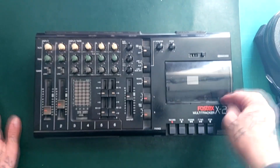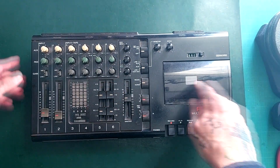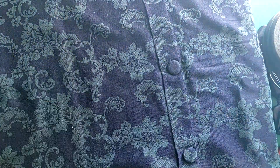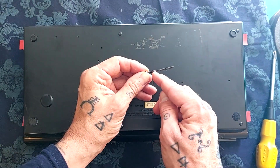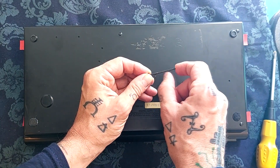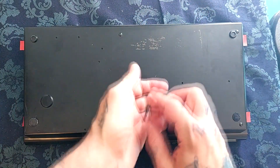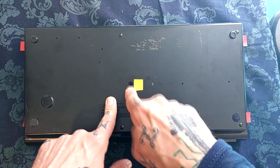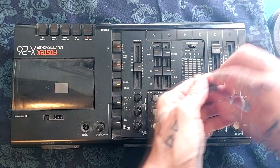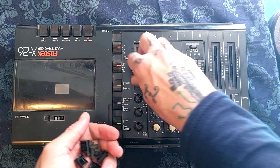Okay, so it looks complete - I can't see any missing knobs or anything like that. Next thing to do is figure out where the screws are on the back and put down a cushion so I don't damage anything on the front. Often from experience it is a longer one in the middle - we've got this smooth flange and a longer threaded area, whereas the one at the side is shorter. I'll put a different color of tape here to show it's a different kind of screw.